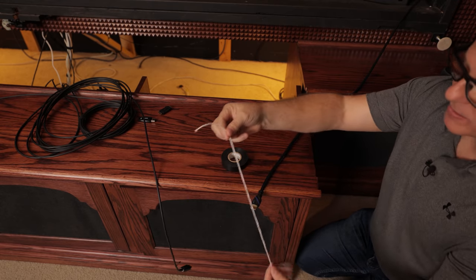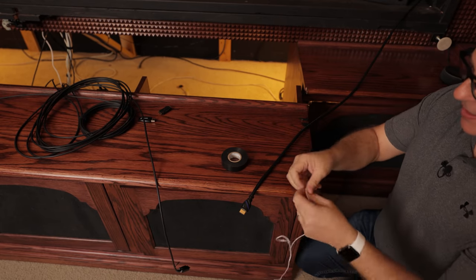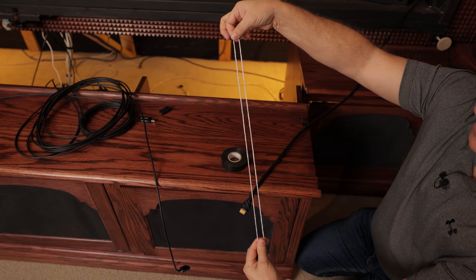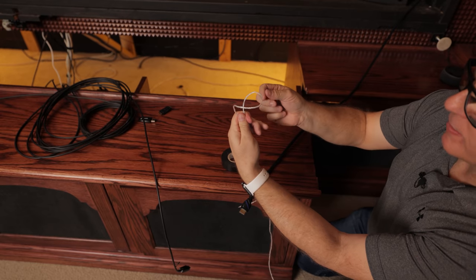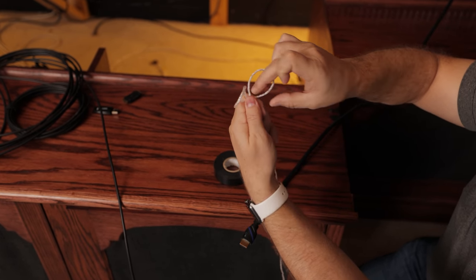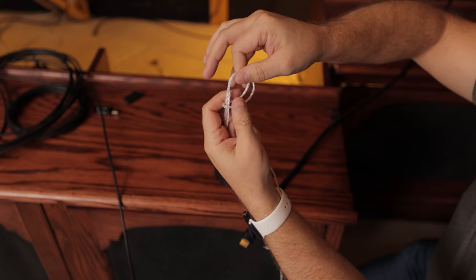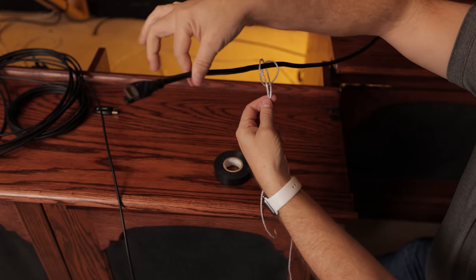The first things we need are some electrical tape and some thin string. I'm going to teach you how to tie the string to the cable so we can attach the two together and pull them through the wall. Take the cable, get about two feet of extra, and fold it over one time at the top. Then push it up against those two pieces and pinch it — you've got kind of like rabbit ears. Fold it backwards to make a loop, then feed the cable through that loop about a foot.